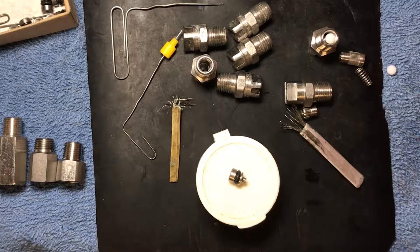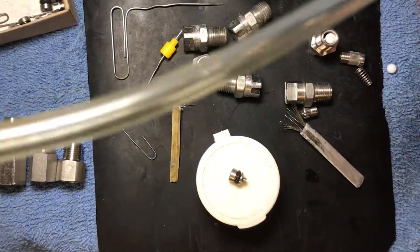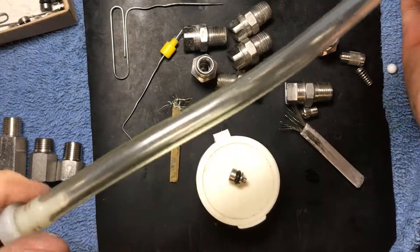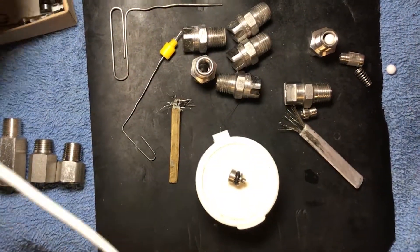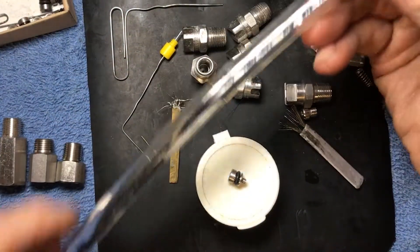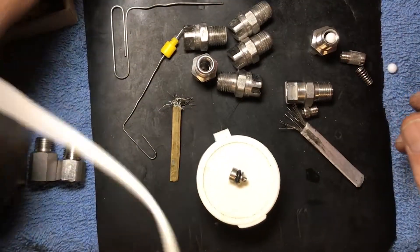This draw tube and the stainless nozzle bushing are the two things I replace on pretty much every injector that comes through here — because they're always bad. This one isn't even used and it's already flimsy — lousy tubing. It's designed to fail. Get mine and you're going to get at least a good, hard year of hot water usage out of it.